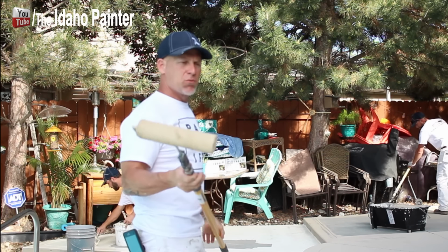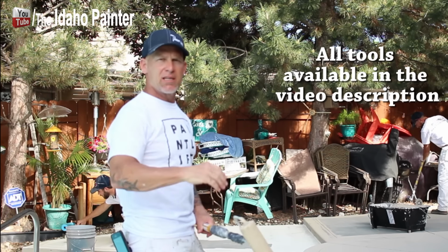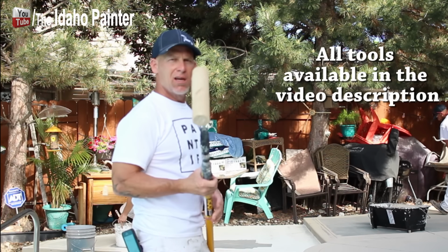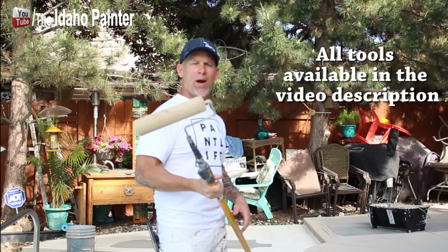We're using 9-inch rollers. We could use an 18-inch roller, make it a little bit faster, but we got some things to work around, and there's two of us, so we're just using the 9-inch. We're using a 3/8-inch nap. These are Purdy White Dove naps.